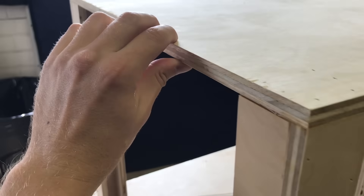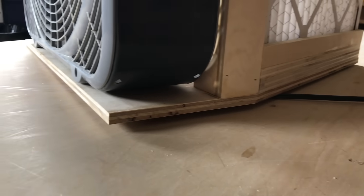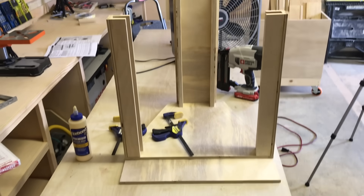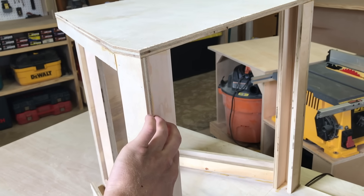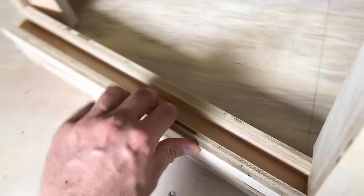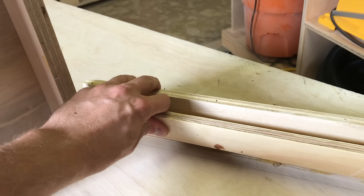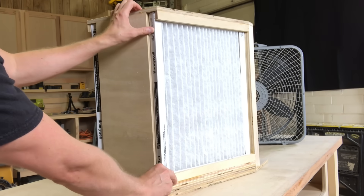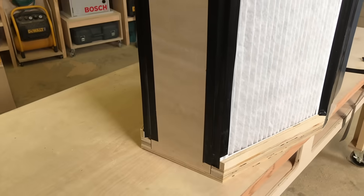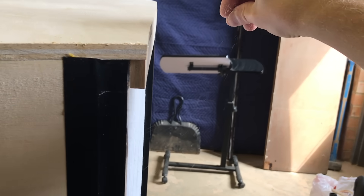But I wanted something a little more durable, so I built this simple frame. It's just half-inch plywood designed to hold two 20 by 16 filters in a system of cradles and slides. I started by shaping out a couple of trapezoidal pieces, including a bottom one with a lip for the fan to sit on. Then to create the interior space, I made plywood stilts that would prop the two trapezoids about 20 inches apart. I created flat surfaces for the fan to butt against at the front, then a narrow wall at the back. The slides for the filters are just built-up plywood pieces — I roughly mapped out perimeters with a pencil, then started ripping, gluing, and shooting on plywood pieces that would cradle a one-inch filter. What I wound up with were these diagonal slides in a pretty decent little frame. There were gaps around the filters that would let a lot of air through, cutting down on filtration, so I just covered these with duct tape — pretty much the original intended use of duct tape. This let the fan create a lot more draw, and more fine particles got sucked into the pleats.